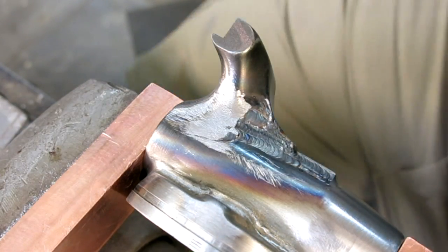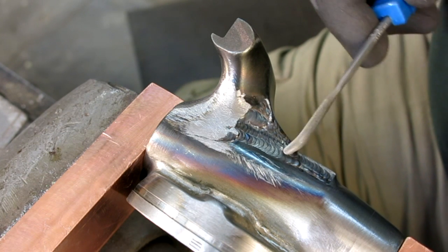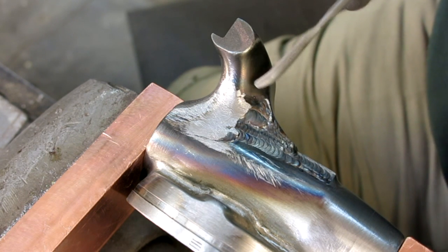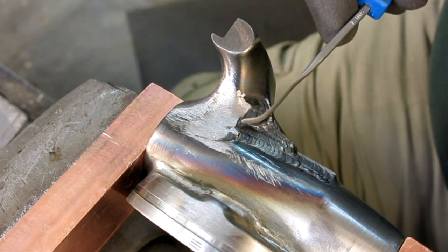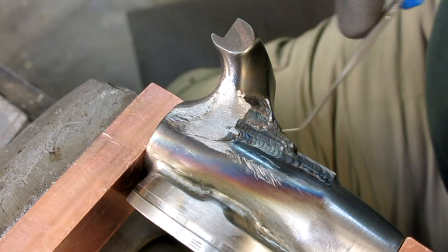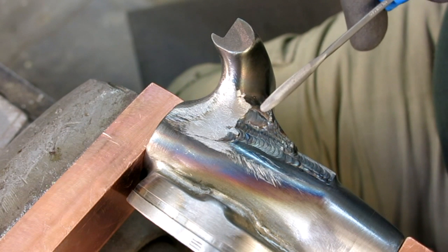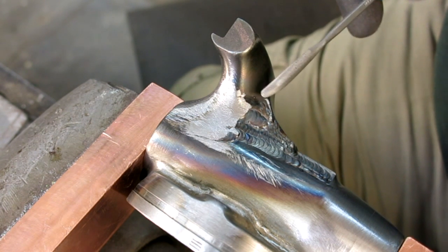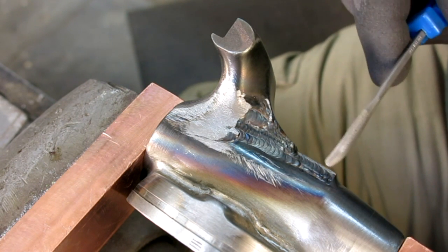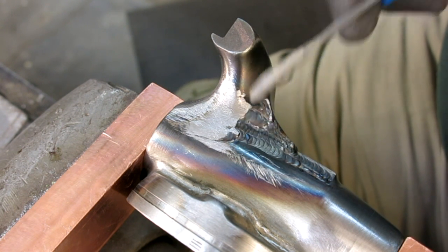So we've been working on this thing pretty good. I'll show you the other side in a sec, but you can see the welds joining it to the body here. This area and this area are the tricky areas — you've got to get it filled up enough so there's something to work with to get the tangencies right. This area in particular is deliciously complicated, but it's totally worth it — it comes out really good. I've had to go back to a couple of little low spots that I've had to fill up.